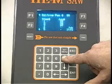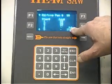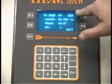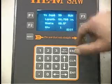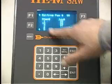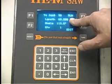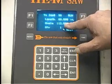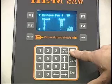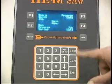If you don't know what a particular job is, you can press the job info key — it'll tell you the length, the angle, and the quantity. We can go down and look at step 2, job 98: press job info and it shows that angle, that length, that angle, and that quantity. That's basic programming, and there will be a pop quiz.